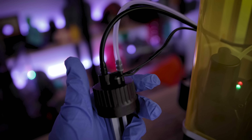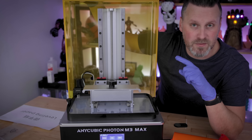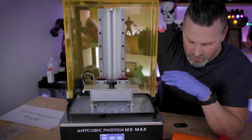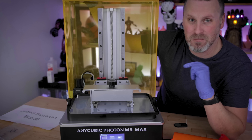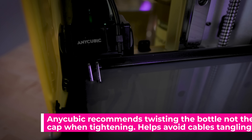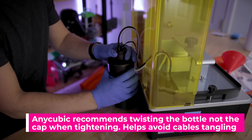I went ahead and hooked up the auto feeder tubes following the included instructions, attaching the tubes to the appropriate ports on the machine. I also filled up the vat with resin up to the max fill line, then lowered the build plate all the way to the bottom to make sure it wouldn't tip over and spill resin before installing the auto feeder. What's also nice is there are LED indicators on the auto fill mechanism — I've got a green light meaning it's powered, and there's also a red LED that's not showing because it's sensing there's resin in the vat. The needles are detecting resin and we can install the actual probes.